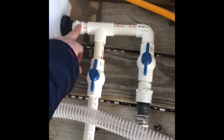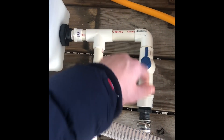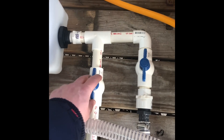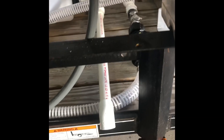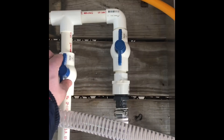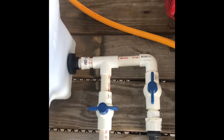Out of my tank I have a fitting going to a 3/4-inch pipe, then a 3/4-inch tee — it's all 3/4. This is my shut-off, bucket fill, and drain. It goes out to the side where I have a little spout at the end, just in case I need to fill up a bucket or drain the tank. That shut-off will always be closed when I'm operating.